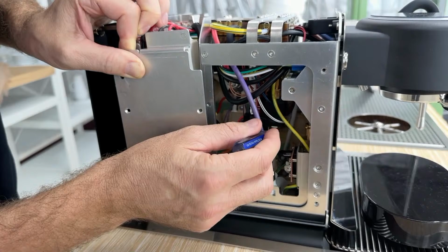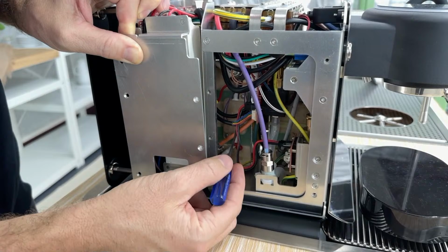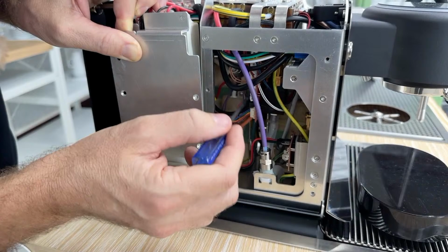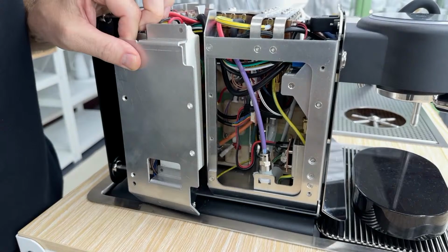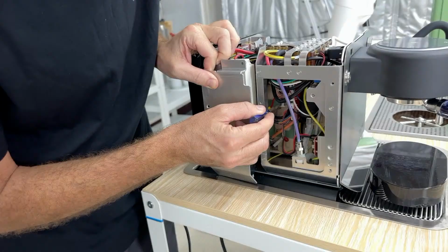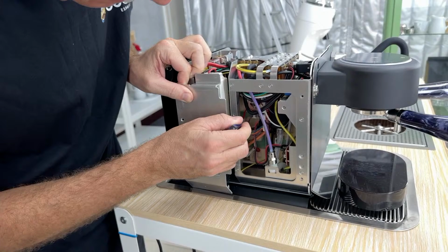Now, if you are someplace that has more power, then we're able to give this hot water heater more power. And the more electricity you have, the more we can put both heaters on to give you more and more steam power. Okay. And that's why, actually, I haven't mentioned how steam works yet. The way that steam works is it works by flash heating the water to 160 Celsius. So there's a pre-warm stage here and then here.